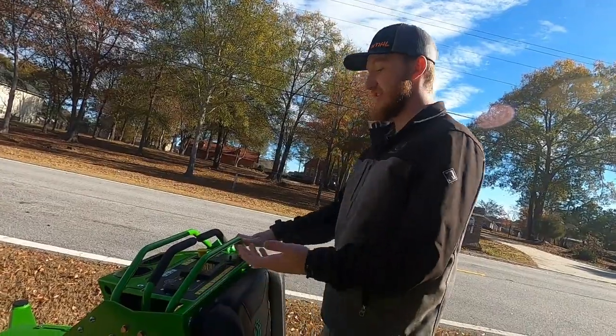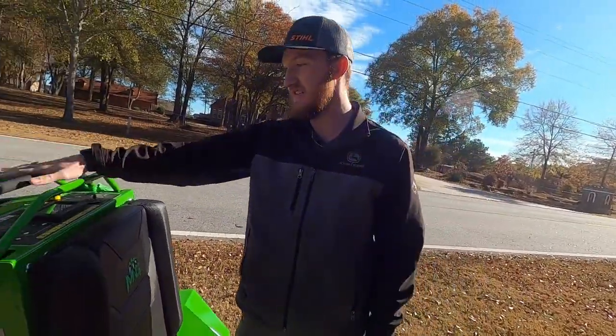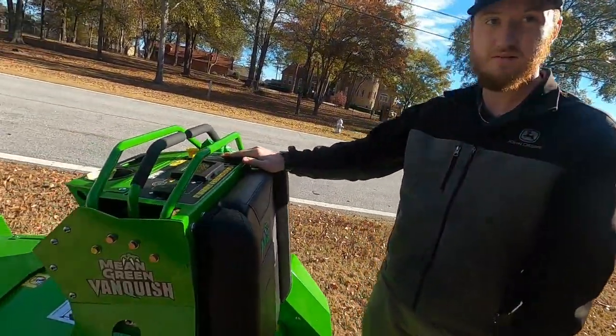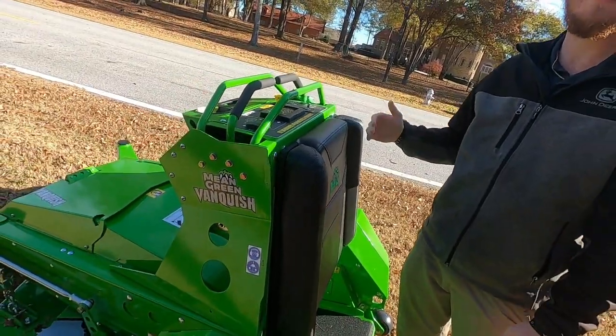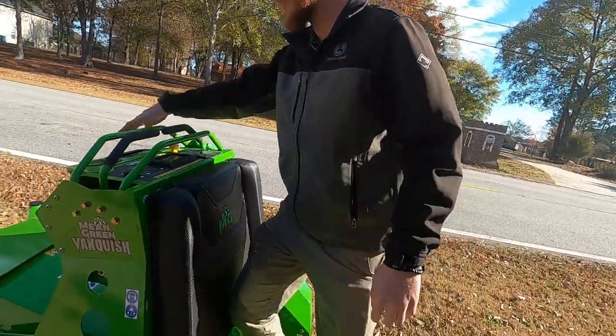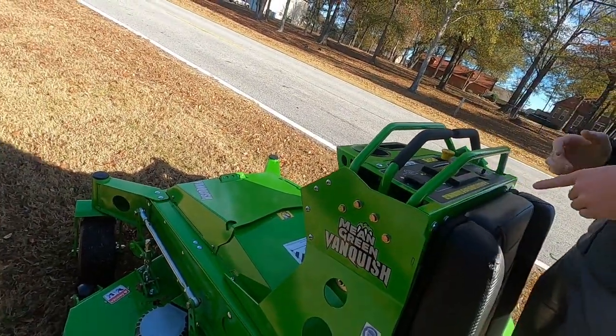And that's another thing. Generally, when you stand off of a mower and that safety isn't on, it's cut off. So when it's in this middle position, that's pretty much it. Even if the blades are engaged, you get off, it'll cut off. Also, if these red lights ping for too long, it'll kick the blades off to save the motor. For a safety reason.